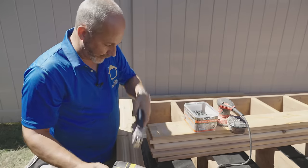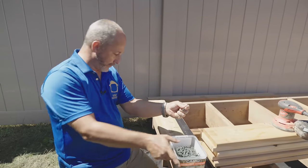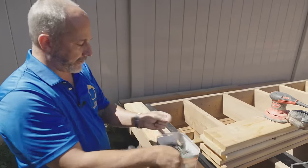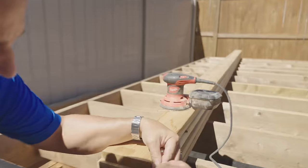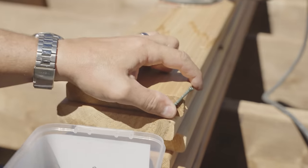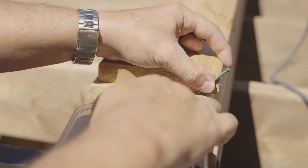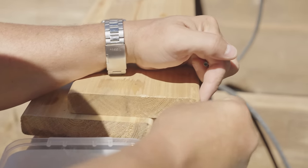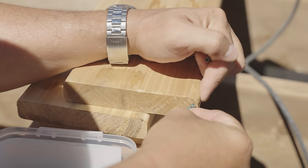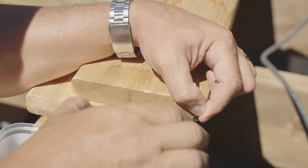I'll just demonstrate that on real wood. Why not? Here's the screws. They come in two different sizes. The short screw is 1 7/8. Okay, it goes off the board like that, around the corner. Okay, and then it goes into the joist down here. And when it's fully engaged, the screw will be down here like this, underneath the surface of the wood. Okay. And you'll have one on each side, causing that pinching action to keep the boards from warping.